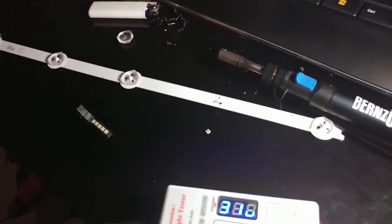We're gonna test this out to make sure it's three volts or close to three volts. Let me turn this off while I put the test leads in — you saw that light up. We're getting about 2.7 to 2.8 volts, so that's a good indication that it's a good LED and we're good.